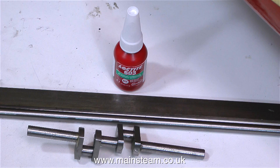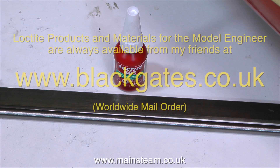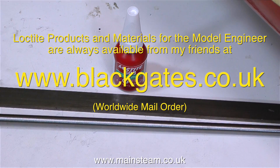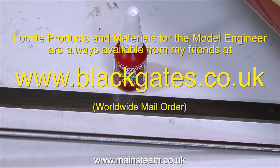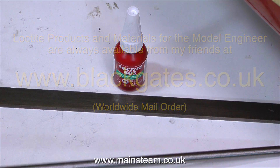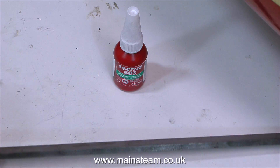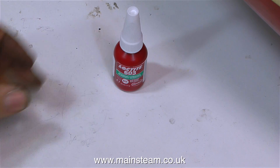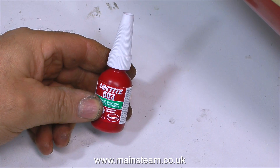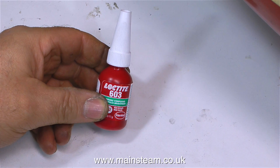One quick trip to Black Gates Engineering, and I pick up these. I bought some Loctite 603 and two pieces of metal. This will make the crankshaft — it's a piece of silver steel, five-sixteenths in diameter. I already had some of that but needed more for stock. And a one-eighth thick piece of steel bar. The Loctite 603 is still my favourite; I don't think I like the viscosity of 638. So in one of the episodes of this series, I will be making a new crankshaft from scratch.